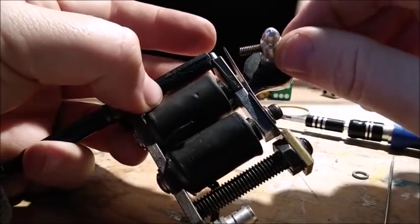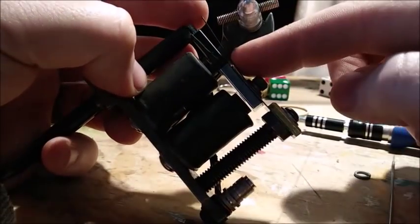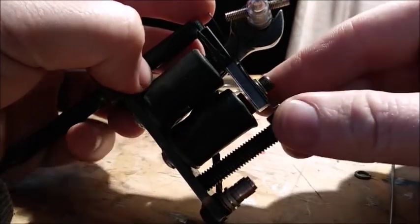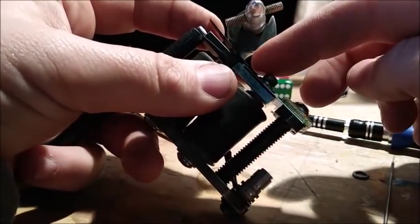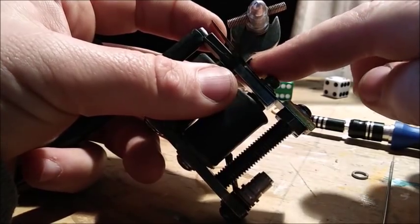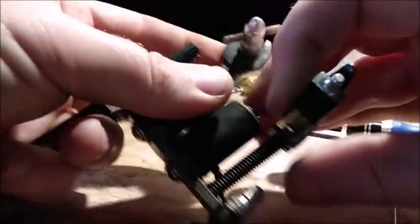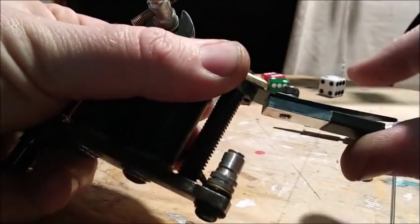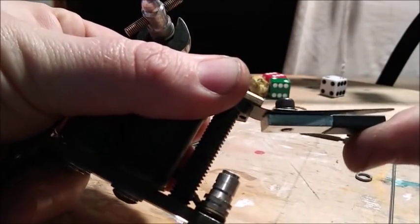So what you're going to run into when you put your springs back on is this. Your contact screw is not touching the front spring. Your front spring isn't up far enough. There's no upward tension. So what you have to do is bend your front spring. You have to take your spring out to the side and give it some upward tension.